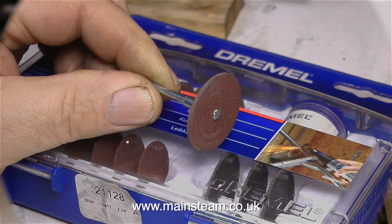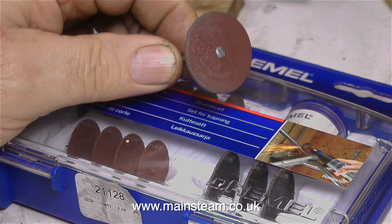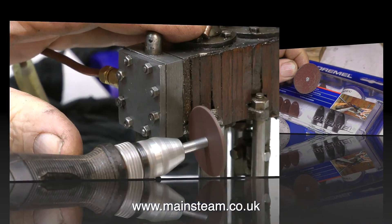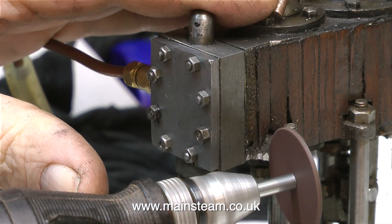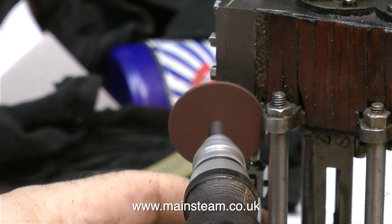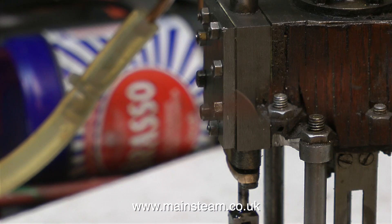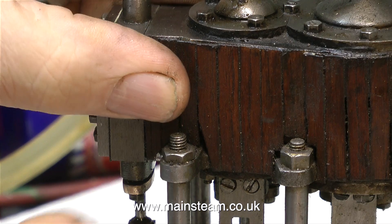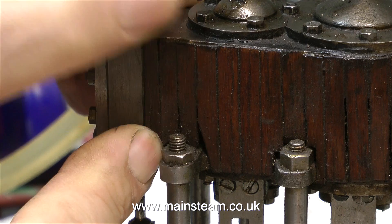While editing this video, I noticed that one part of the casting around one of the cylinder mounting lugs is very rough indeed, so I'm going to use one of these cutting wheels to just clean it up. I'm being very careful with this cutting disc not to accidentally slip onto a visible part of the engine like the steam chest. Once I'd done a rough cut, I took a much finer cut and got quite a smooth finish. I did of course cover up the lower part of the engine — the bottom part where all the bearings are is not being contaminated by any grit and cast iron residue.